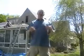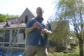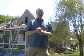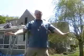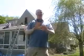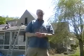Most homeowners ask me: should I strip off all my shingles, or can I go over my current shingles that are already on the house? That's a great question. The number one thing we want to look for is whether it's a three-tab shingle — the kind that lays flat. If it's in fairly good condition and laying flat, yes, we could go over it with a nice architectural shingle.